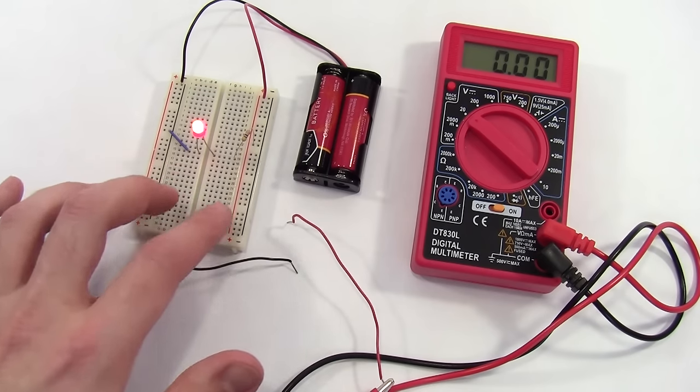For example, take my circuit — if I had something wired improperly and wanted to confirm there's a conductive path between a leg of my LED and a wire on the battery, I can test both sides of the LED. If I get a beep on one side, I know there's conductivity there. But if I test the other side and there should be a connection between the LED and the resistor but I'm not getting a beep, I can realize I have that wired improperly. Similarly, for cables, touching probes to both ends of an alligator clip — if I get a beep, the cable is good; no beep means the cable is probably bad.